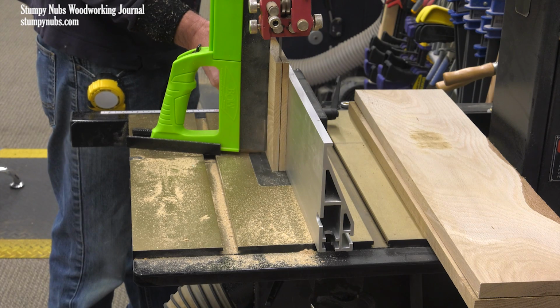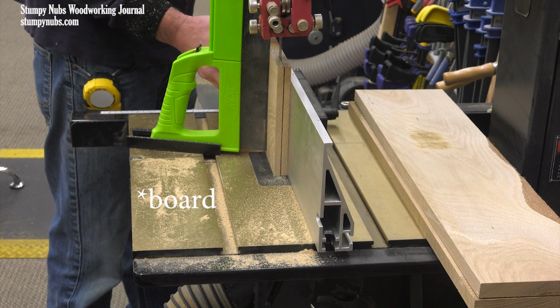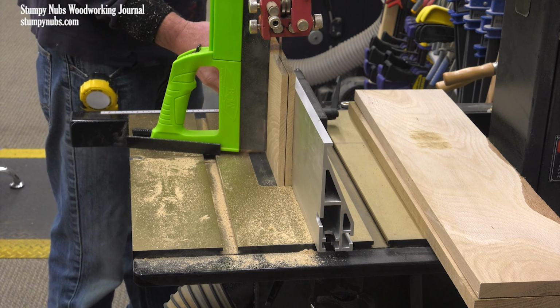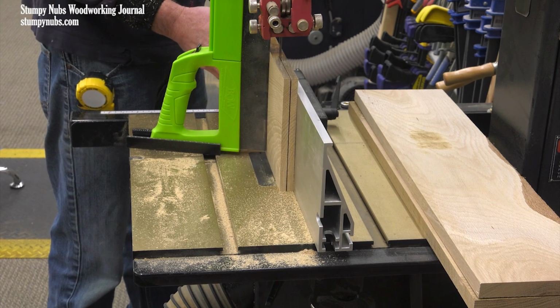Now your surface is so rough you have to go and rejoint the face between each slice. And more wood is becoming waste. When your blade was sharp, you could slice a 3/4 inch board into equal pieces of nearly 3/8 of an inch, give or take a 32nd for your kerf.